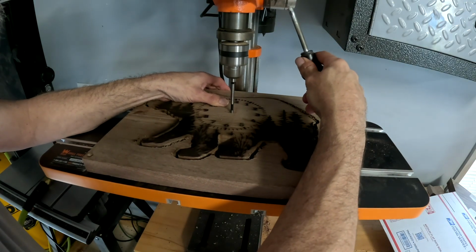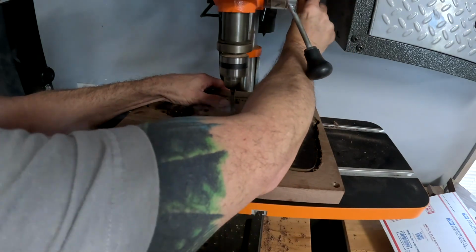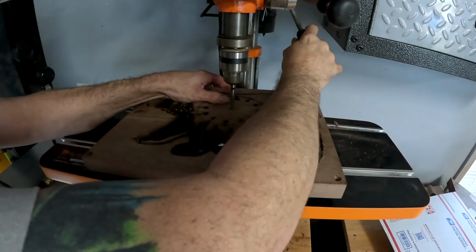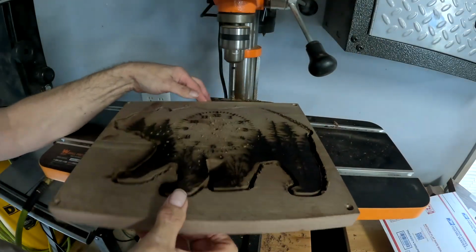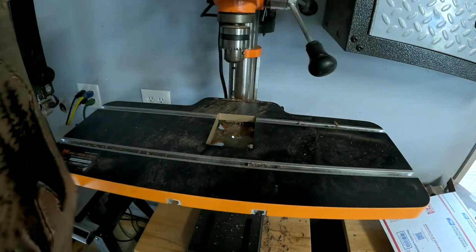And same on the back, when you go to put in the mechanism, you can do it old school. You can use a chisel, you can just use a drill and drill it out and then just square it up if you want to. It's just a lot easier if you have this extra bit of equipment to make this happen, but it can be done without the equipment.